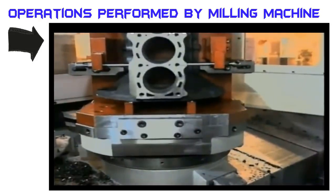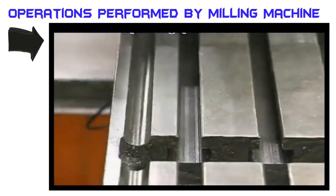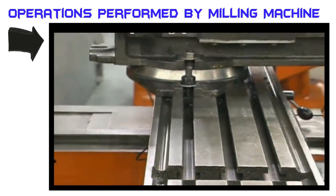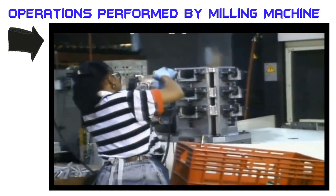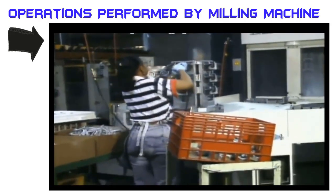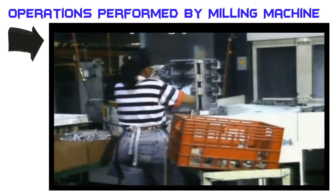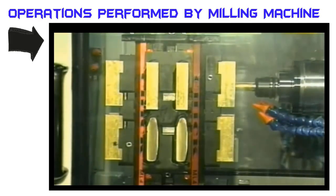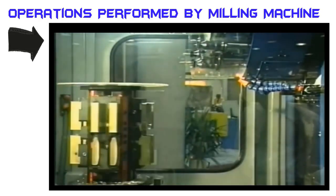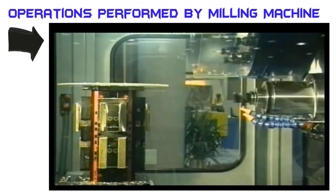The HMC table typically rotates to expose four sides of the workpiece or fixture to the tools. The T-slots of the machine table are the primary means of holding work and workholding devices to the machining center table. Tombstones, commonly used on horizontal machining centers, come in a wide variety of configurations to hold multiple parts. The part program is written to machine all parts on the tombstone before shuttling it out of the machine. Setups on machining centers often utilize multiple vices in a variety of arrangements, which may be arranged on an indexing device to further expand the parts-carrying capacity of the machine table, often working in conjunction with rotary tables.